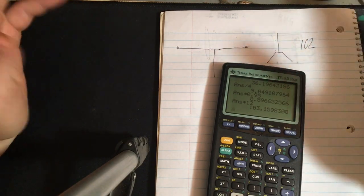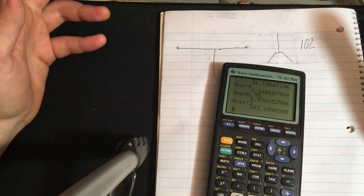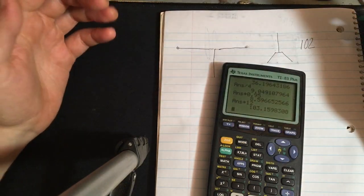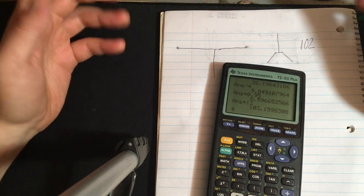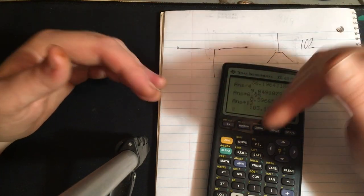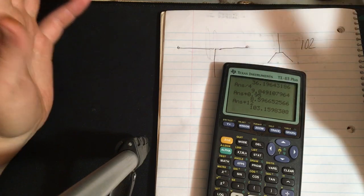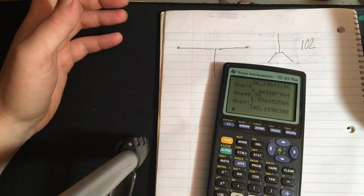And that corresponds very closely to the 102 steel whip that we see. Now, of course, an inch isn't going to matter too much. You have a lot of variables. For one, you have spacers and washers and things underneath that steel whip to make it longer, usually. But also, things change as you get closer to the ground and above the ground. So around 102, 103, 104, something right there is about right. I usually go about 106 and then trim down to resonancy.